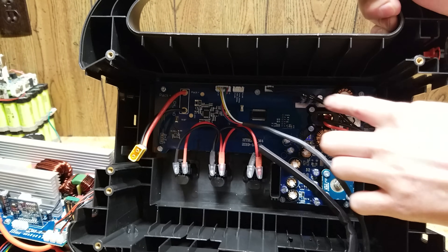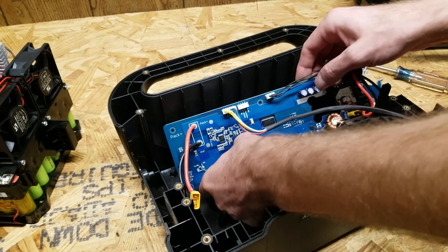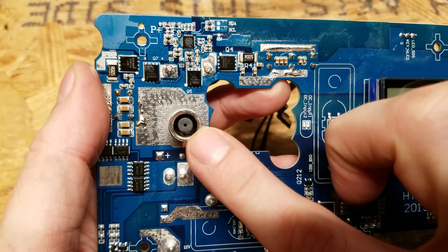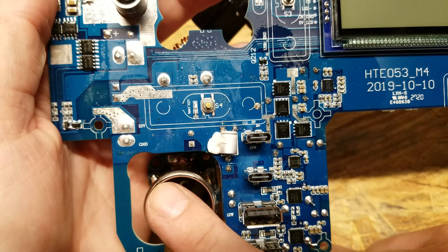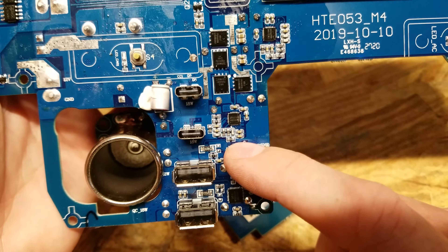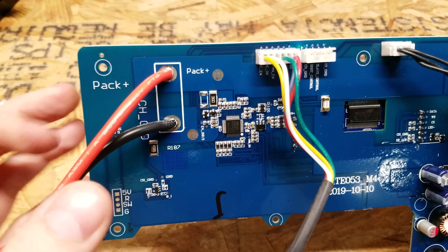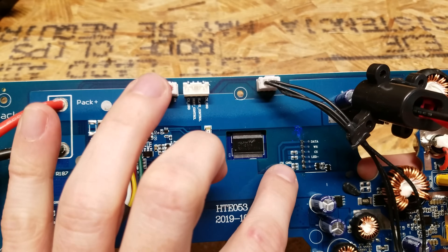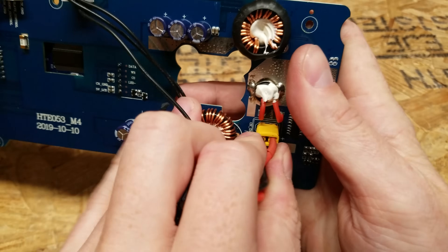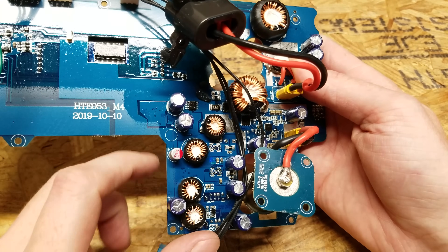On the front part of the enclosure there are several Phillips screws holding the PCB in place. I'll be honest, I don't know a whole lot of what I'm looking at here, but this is the barrel input for the solar panels. We have the cigarette lighter or accessory port, and the two older-style USBs appear to be individually controlled, which makes sense since one was quick charge and one was not. There appears to be a single chip to control both of the USB-C ports. The main DC input to the board is an XT60 plug. The power pole for the front input is connected to the circuit board with an XT30 connector, as is the accessory port. And there's an individual inductor for each of the USBs.